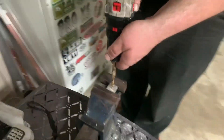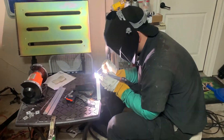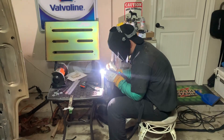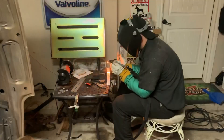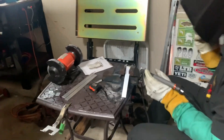On the front we're using the same bolt that the fuel pump mount hold-down uses, and on the other side there's another threaded hole we're going to use. We'll fab up some brackets, we got measurements on how long the four straps need to be, and we'll get these ears Matt's working on welded to the longer straps so we can use through bolts. Matt's going to learn how to weld aluminum tonight — teaching him on AC aluminum TIG. It's been a long time for a spot weld. Sounds like you dipped it — you didn't get enough heat. You need to mash the pedal until you see a puddle and then back off a little bit.